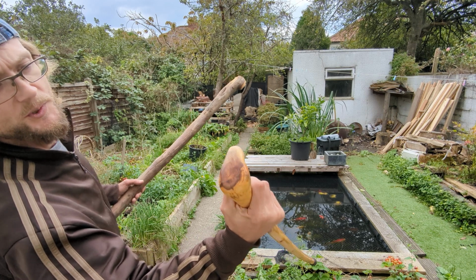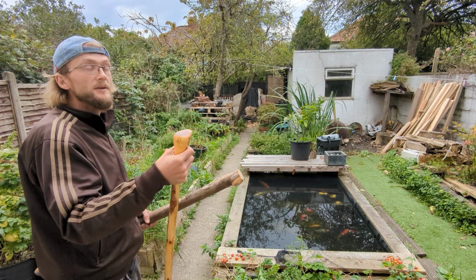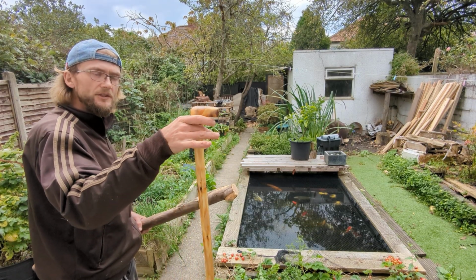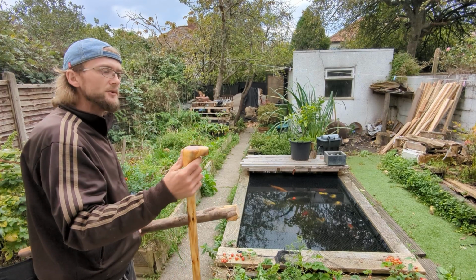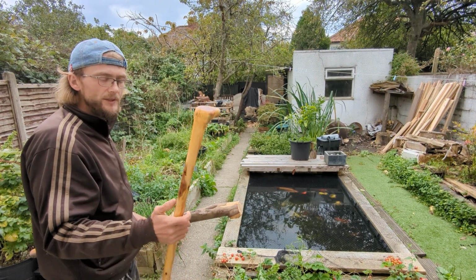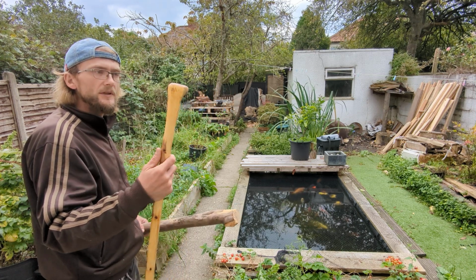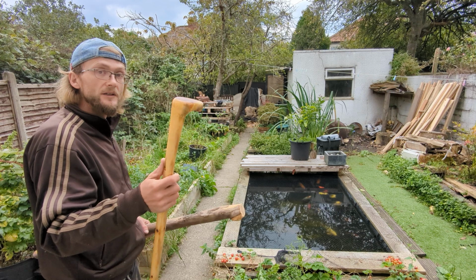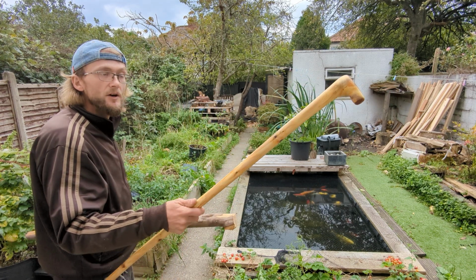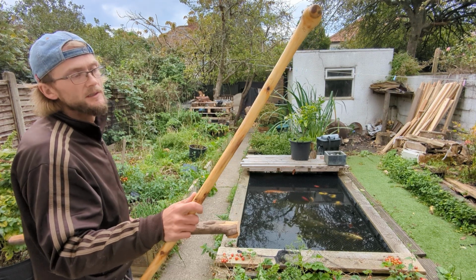And you get it super smooth and nicely oiled. That's the next thing to mention, your oil. These guys, I wouldn't do it with the 60 grit. Once you've done most of your sculpting and got your tooling marks gone, wipe it down with oil and then maybe do a few deep soaks between 60 and 120 grit. Once you go past 120 grit, the oil doesn't really soak up the dust, it blocks it up. But I do like to use oil between all of the grits of sandpaper to help lift dust up out of the way. And it seems to work.